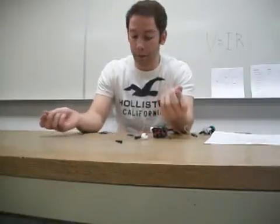Okay, when making the circuit for the motor, we'll use the motor, some wires, some batteries, as well as 2 switches. First, we're going to attach 2 wires to the motor and attach it with electrical tape. I've also attached electrical tape just along the way to hold the wires together. At the end, you're also going to make each of these wires split into 2 other wires just by stripping the end of the wire and attaching metal and then electrical taping together so it is covered. If these 2 wires come from this orange wire, then one is going to go to one circuit and be in series with the batteries and the switch. The other will go to the other circuit and likewise be in series with a motor and a switch.